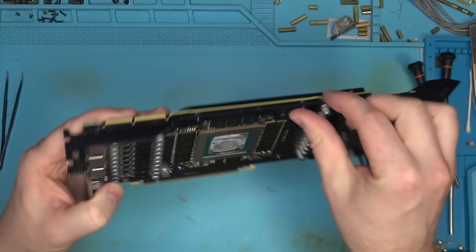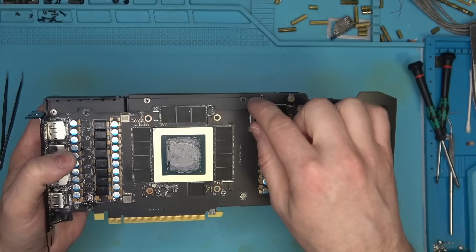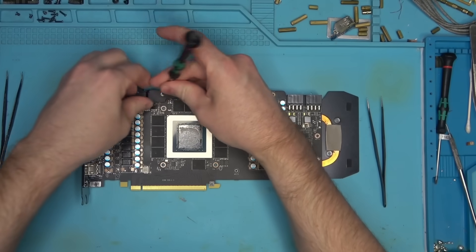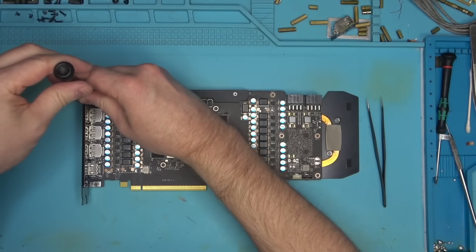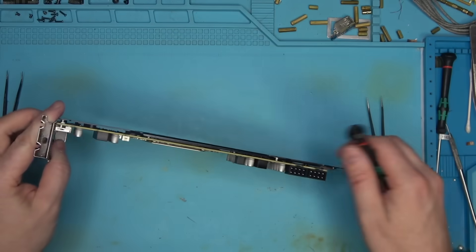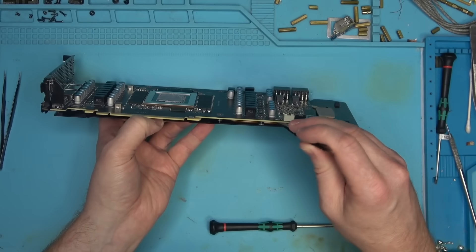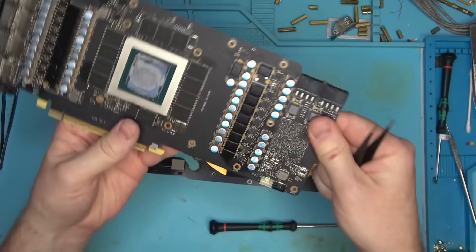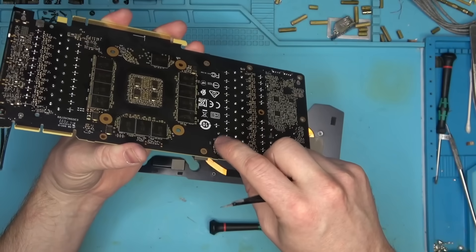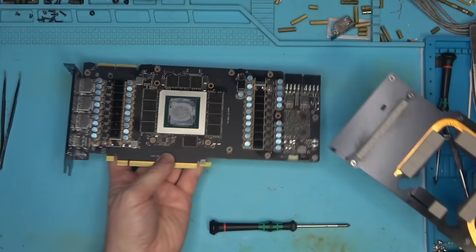This is basically the bracket I was talking about - it's just this long piece of metal. It cools the PCI Express buck converter and also cools the memory driver MOSFET. Now cooling the PCI Express isn't critical, but not cooling the memory driver MOSFET is kind of critical. So I ended up stacking thermal pads up in here against the backplate so that heat will be sucked away by the backplate. This is the chip I needed to cool, and since I didn't have the bracket I stacked pads against the backplate - that's all I could really do.